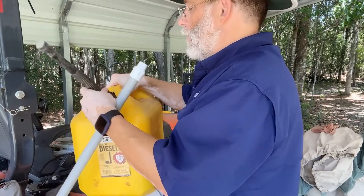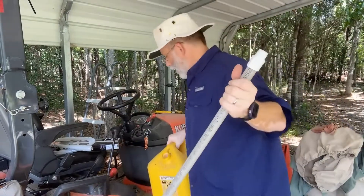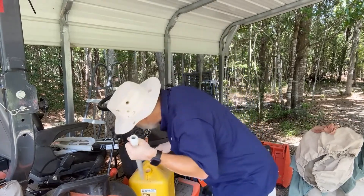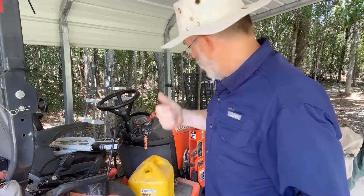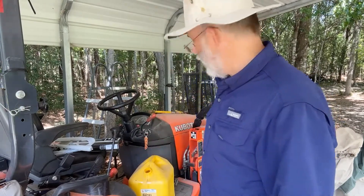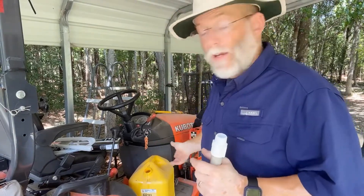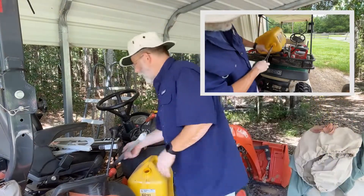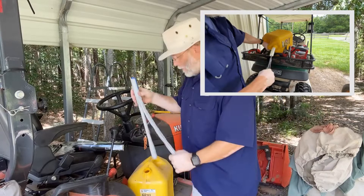What I'm going to do is take this piece of PVC — a broom handle or whatever you've got — and basically just pop that filter through right there, and that was it. There's a whole video showing multiple people taking pliers and trying to pull it out, but it has a couple of clips on the side that make it almost impossible to remove that way. Now that it's inside the tank, I'll get it out after the tank is empty — just put pliers in and pull it out. Now I can use the siphon and it's so easy it's ridiculous.